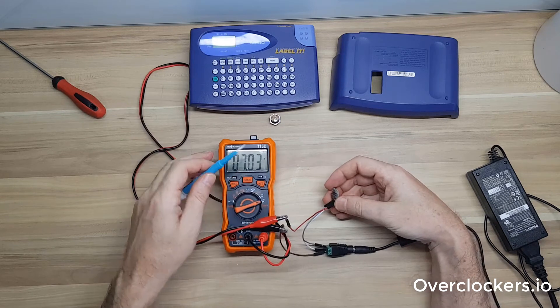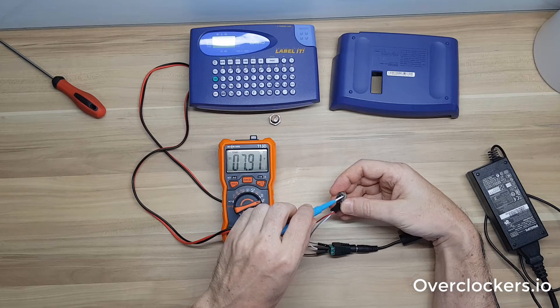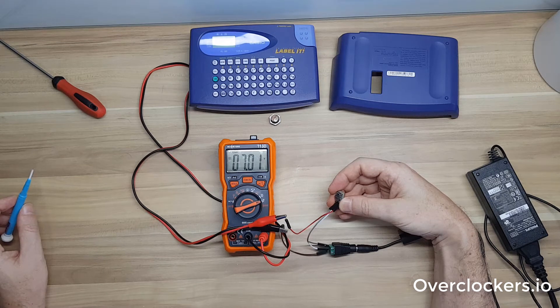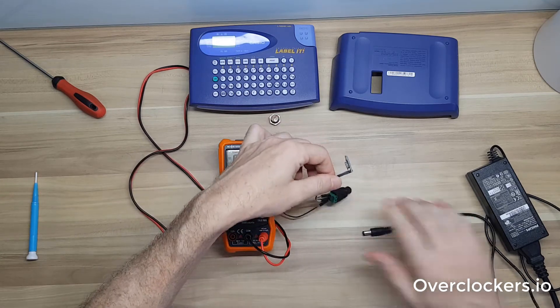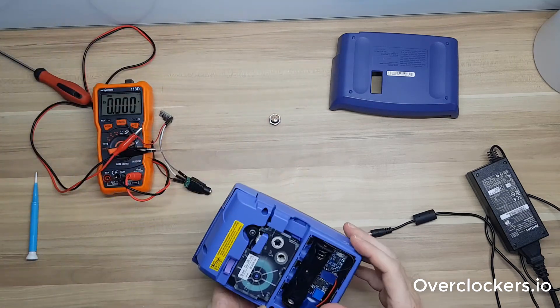It's currently at seven volts and you can just adjust the potentiometer to change that voltage quite easily — it's very sensitive. I could set it at nine volts, but I'm actually going to keep it at seven volts so I know that switching over to nine volts is working properly when I do the solder bridge. I'll unplug this and now let's take a look inside the Casio.